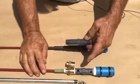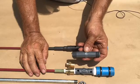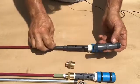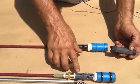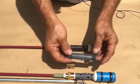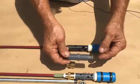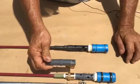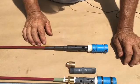This is your standard piece of PVC pipe — it's called close nipples. They've got them at Merit Hardware, Lowe's, everybody. Three or four inches is all you need. Drill about six larger holes — five sixteenths, three eighths — and six or eight holes at quarter inch, five sixteenths. You don't want to do so much that you lose the strength or integrity of it. All you need is for the water that comes up through the check valve to be able to get out. Six holes is probably more than enough to do the job.